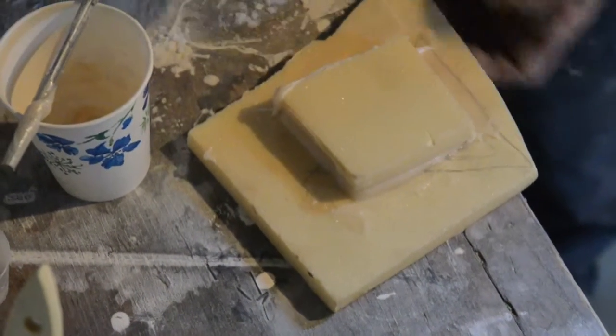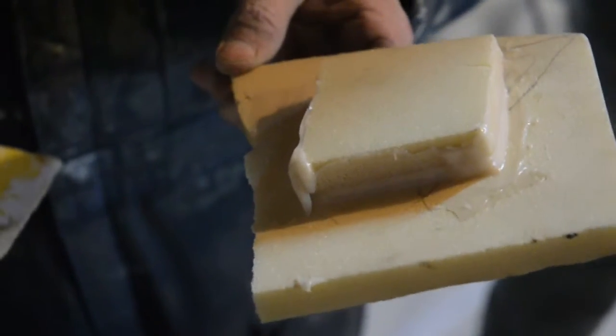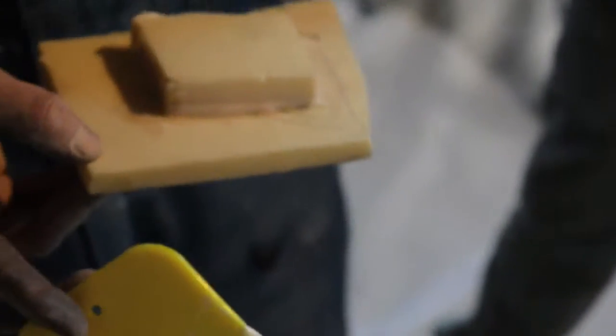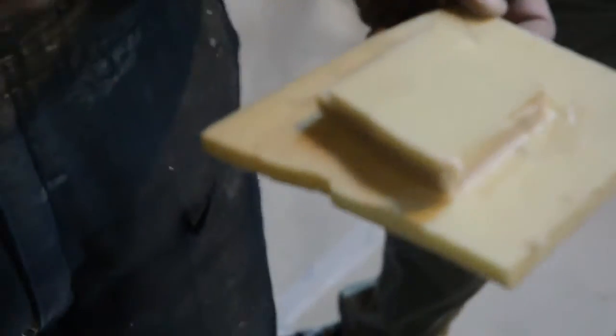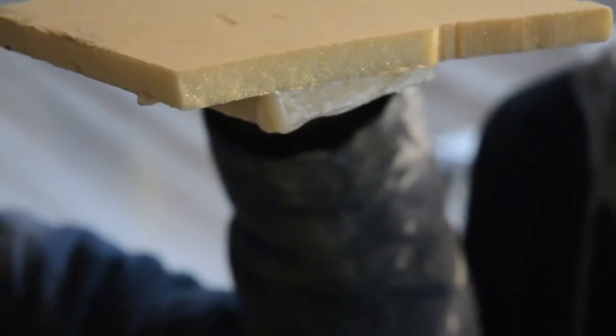Right. So this is probably why we want to suspend it, because the more we push down on the plate when we're laying it in, if it slides back up at all, then you're going to create a pocket. But if you go straight down, we want it to liquefy and be at the height that we want. Cool. Oh, done. Sweet. There you go.